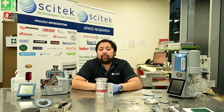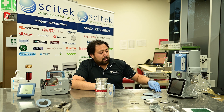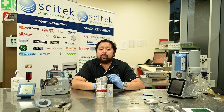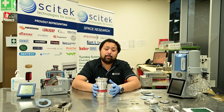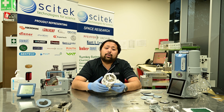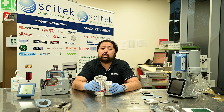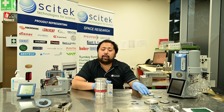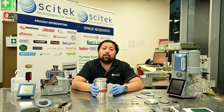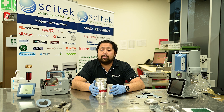These two different types of diaphragm pumps have two very different applications. The non-chemistry diaphragms are best used in applications where they're not likely to see solvents or high levels of moisture — for instance, backing turbo pumps, vacuum storage, and clean chamber applications like space chambers. Your chemistry rated diaphragms are well suited for working with rotary evaporators, filtration systems, solvent purification systems — anywhere where they're likely to see high levels of moisture or chemicals.